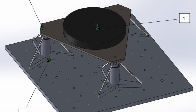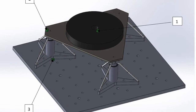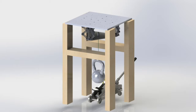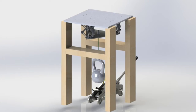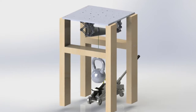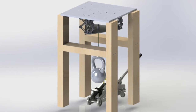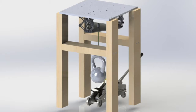The next testing procedure compared damping and transmissibility values before and after testing to note any changes as a result of the loading. To test the quasi-static requirement of 20G in all axes, a weight is used to simulate static equivalent loading applied through the center of gravity. A shaft offsets the load at a specified distance from the flexure plate. These tests include tensile and compressive axial configurations as well as a horizontal orientation.